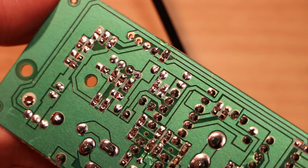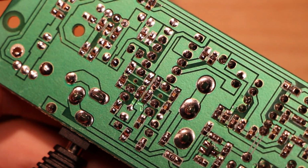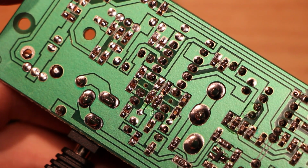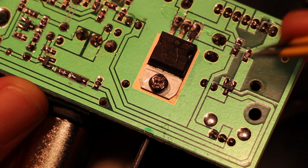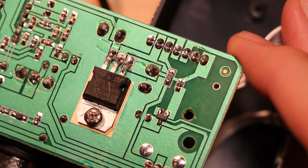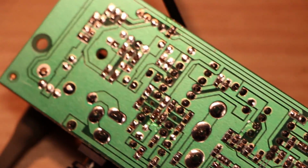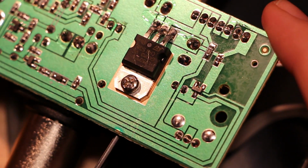It was like that. This is a really strange trace pattern around the unidentified, presumably amplifier chip. That's the kind of layout you would see around a really sensitive input that needed very low leakage current. Yeah, so that's interesting. This next pin just seems to head off to some of these unpopulated lands over here. I want to know what this little 3-pin device is for.